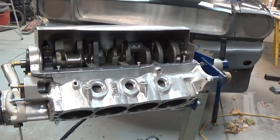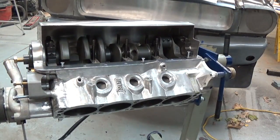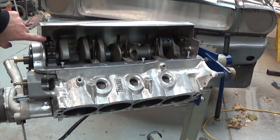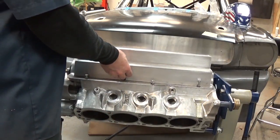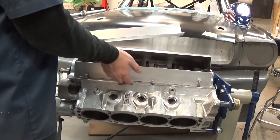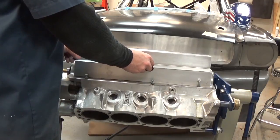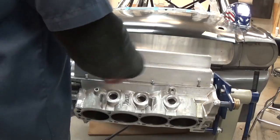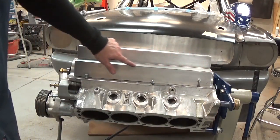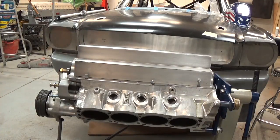The front and rear pieces are made out of 6061 flat stock, but this rounded section I made out of 3003 because 6061 just isn't going to enjoy that bend. Got it all tacked in place. I still have to make the far side that has the pickup. That gives you a good look at how much room there is from the crankshaft to the bottom. I tried to make the far side in one piece with two breaks, but I totally wasn't up to it today. The second bend radius was too tight, it started to crack, and the vertical piece didn't fall where it needed to, so I just cut it off and redid it in two pieces. We'll have a weld seam running along there, which isn't terrible.